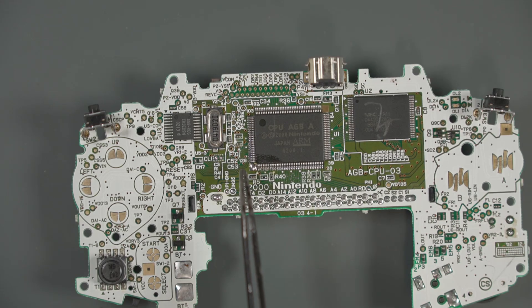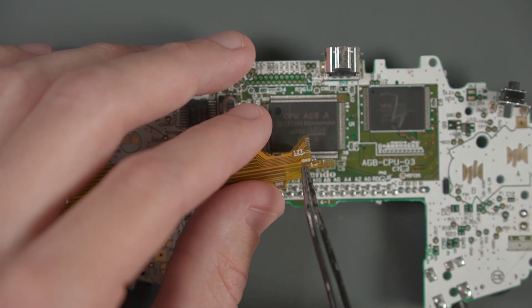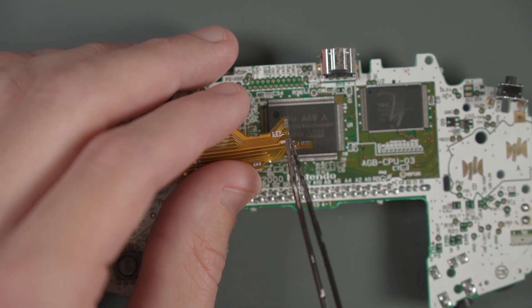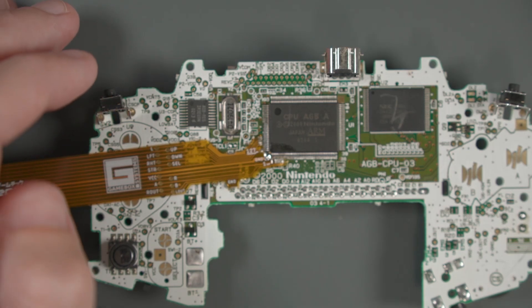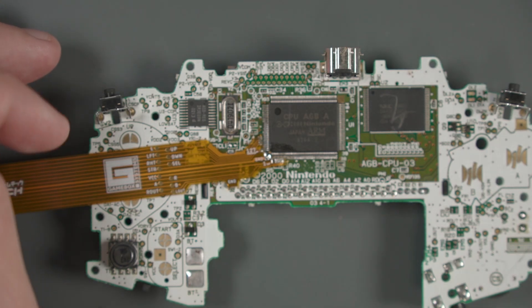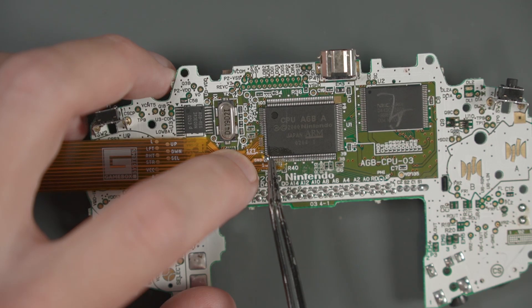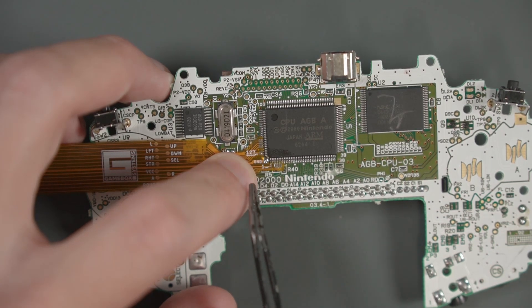If we take a look at the left side of the CPU, you'll see the marking for pin 128 — that is the bottom pin on the left side of the CPU. On the flex cable, there is a marking for pin 127. So the left side of the flex cable is not going to line up with the first pin of the CPU; the first pin we actually solder on the flex cable is one above the bottom left. I'm going to turn my soldering iron down to about 600 degrees Fahrenheit from my normal 650. The first pad on the bottom of the flex cable lines up with the far left pin on the bottom of the CPU, and the bottom pad on the flex cable lines up with the second-to-bottom pin on the left side.